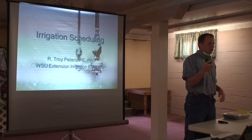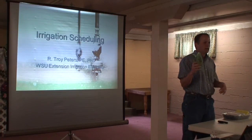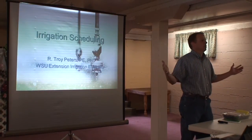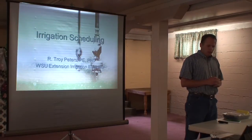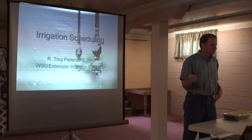There are a lot of formulas in here. There are things you can use to do a pump test, to see if it's time to rewind your pump, how your pump's doing. There are formulas to help you know how much water you're actually applying with the big gun based on what your spacing is, your pull speed, and your flow rate, and a lot of those other things that you probably would need. So, without further ado, we'll reference it as we go along.